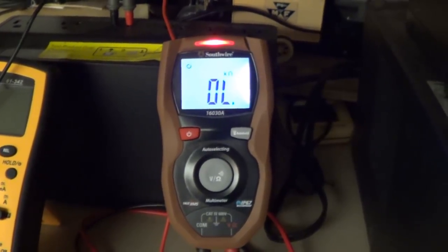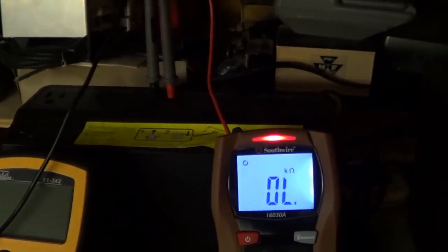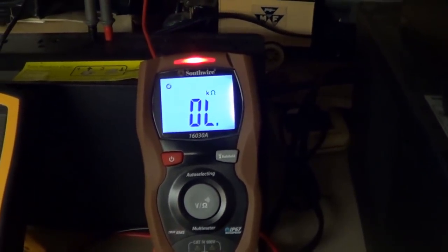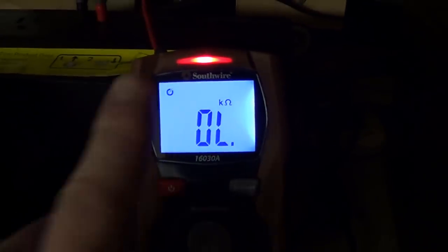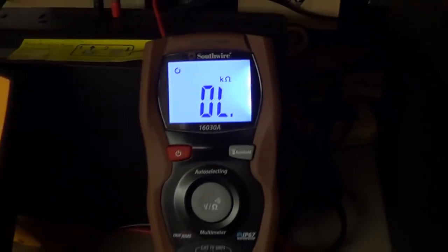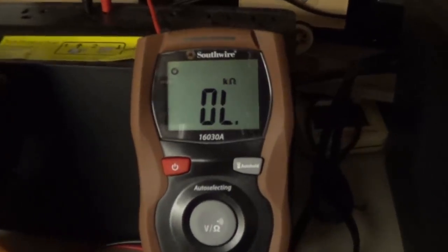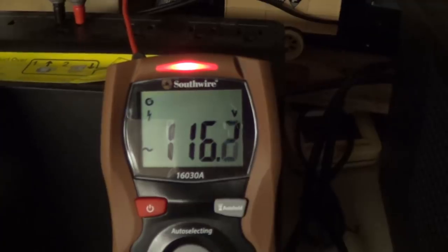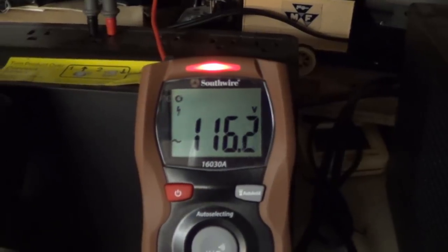For those of you watching, I've gone ahead and hooked it up to this uninterruptible power supply having what is optimistically referred to as a modified sine wave output — which is really a square wave with periodic drops to zero level before the polarity of the waveform reverses. We'll go ahead and turn this back on. Once again I've got the meter in the improper mode of operation. The backlight just turned itself off, which is certainly interesting. But it switches itself to the proper mode and indicates a plausible voltage figure, so this definitely would appear to be functioning as a true RMS multimeter.